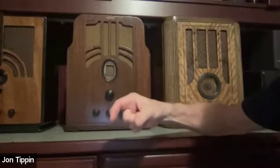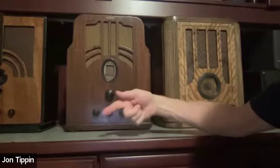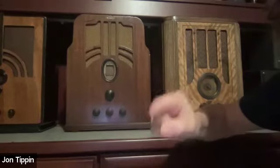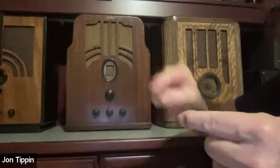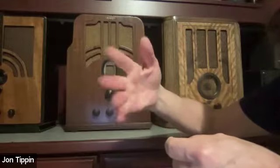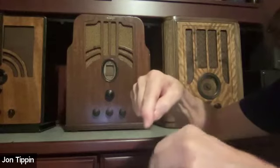Some people will use the blocks almost like a terminal strip. Well, this guy actually took all the blocks out and put terminal strips in for each of them, and then put the components on. So I had to go through every bit of it, and I found one of these strips where one of the lugs had about four things connected to it. The lowest thing, the solder never got down to that one last little wire coming out onto it. It was just sort of hanging there. So I resoldered it, and it works fine.